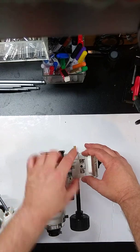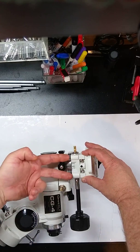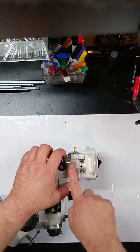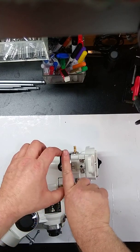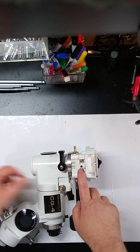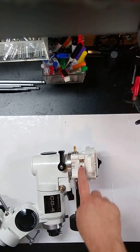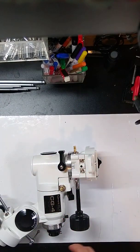That motion — in this view, up and down — is the worm moving up and down. The long screws lock the assembly in place. The short screws and the middle screw: if you tighten the middle screw, it lifts the housing up away from the worm wheel — that's like our teeth opening up, making things looser. If you loosen that and tighten the outer pieces, it brings the worm down and makes things tighter.